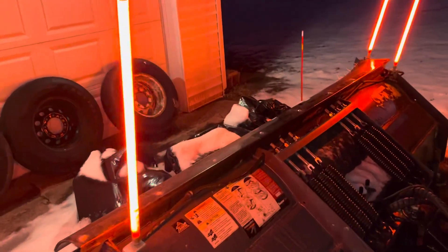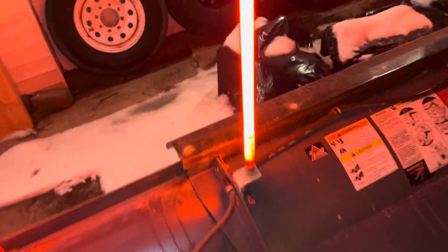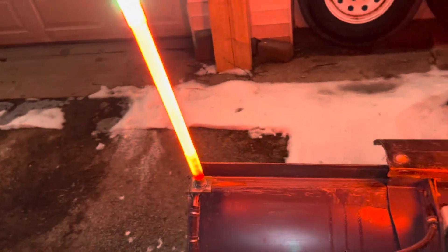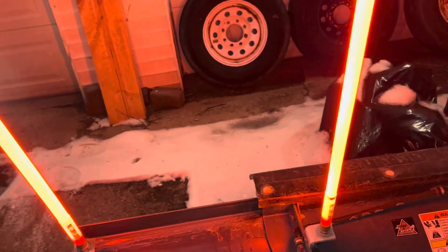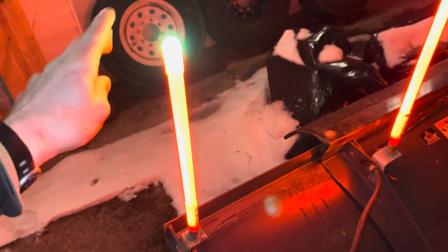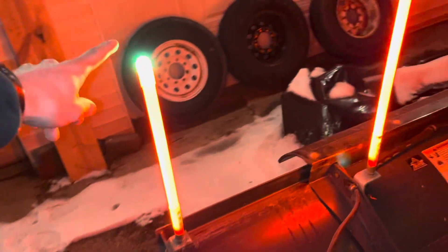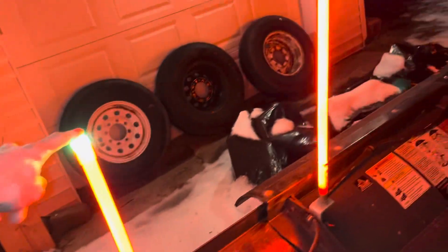This is, I'll admit, a little bit overkill — honestly a lot of overkill. If you're worried about reliability of lights and wiring, I would definitely just mount them on the inside moldboard and leave your standard markers on the wings, or get some sort of reflective marker on the wings. But if you are more worried about clearance, I would definitely mount them on the outside, and I'll explain how I did mine.